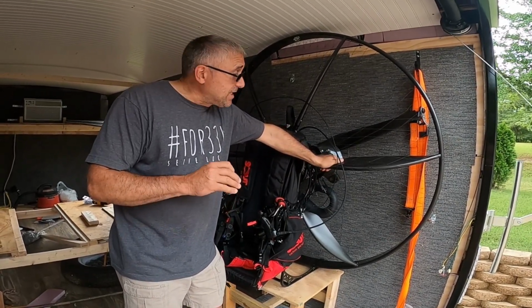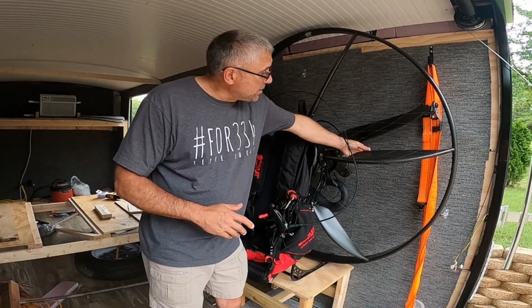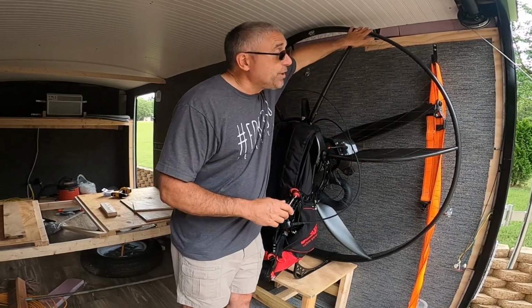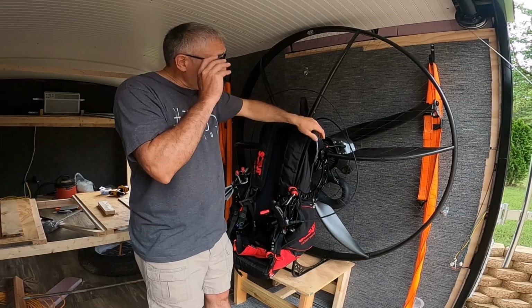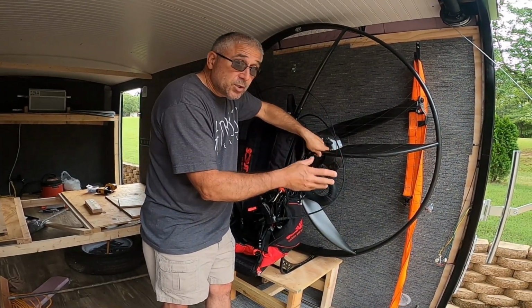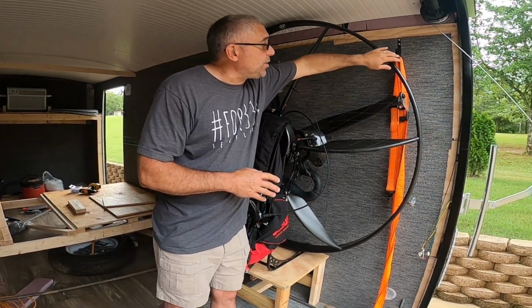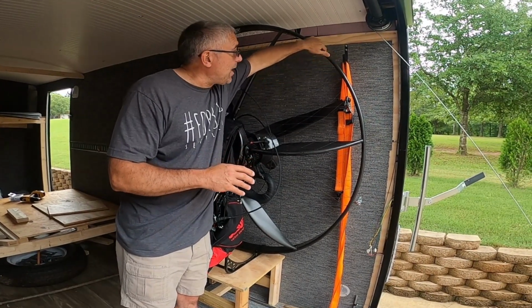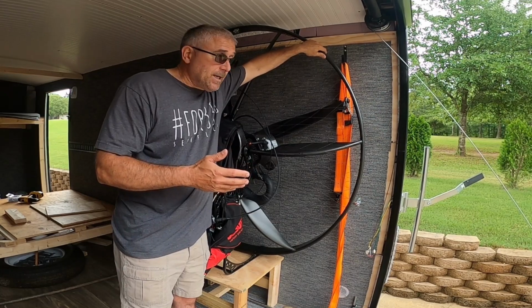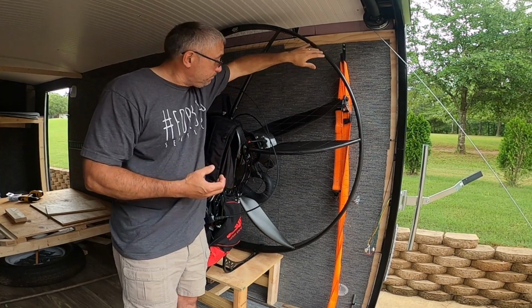And what they've done is they've used something called a dynamic torque compensation system. So each of these fins that look like propellers in a way, coming out and holding the hoop, those fins provide an offset to the torque of the engine. As the engine's torquing it one way, the fins are pushing it the other way as it moves through the air. So out here, the hoop is made with carbon fiber as well, and it's very light. So this provides a unique and efficient design as it flows through the air as opposed to a round tube.